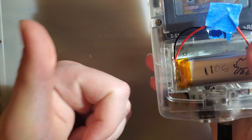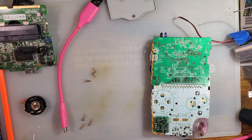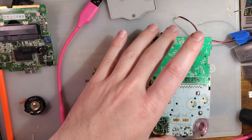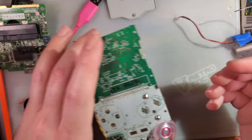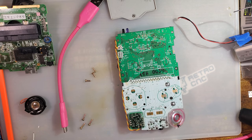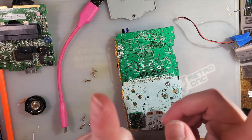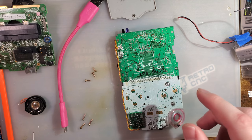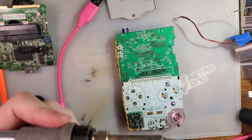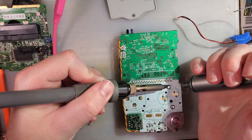Otherwise, that's all I've got. Have a good night, guys, thanks for watching. So I had this thing open, I was doing some work on it, and I decided I should probably add this to the video. So what I did — I opened this up, I swapped out the speaker. That's not complicated at all. I also pulled the back off, made that hole a little bit bigger so that we can get the connector in nicely. Here's the important part: I found the battery that I did actually want to use, so that's what we'll go ahead and install. But first, this mod does basically make it so you can't use alkaline batteries. The battery terminals just aren't connected to anything anymore, so there's literally no point in leaving them. Let's remove them.